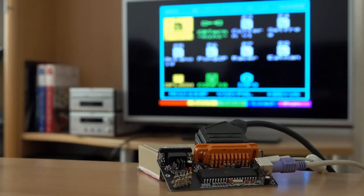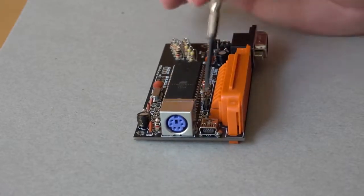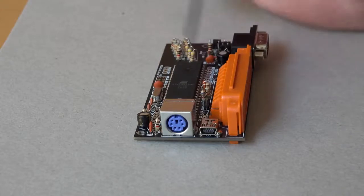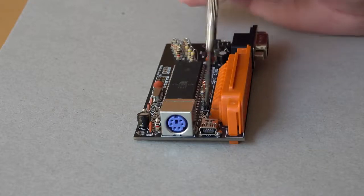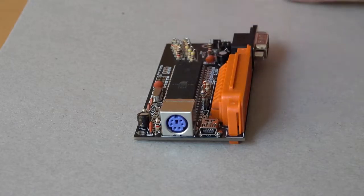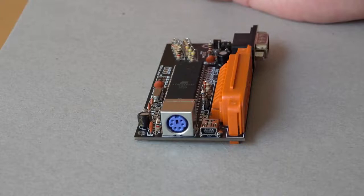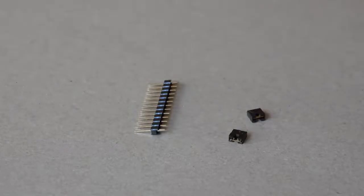The first thing you should know when building your kit is that you need to apply a lot of solder to the sides of the mini USB connector. I applied too little and the front soon came loose — it's hard to fix afterwards because with adjacent parts already mounted there's not a lot of room for your soldering iron. I eventually managed to fix it by adding some solder, and now it's stable again. Also, when soldering the upper parts, always increase the temperature of the soldering station to 360°C, as Casters recommends.